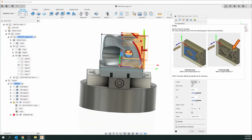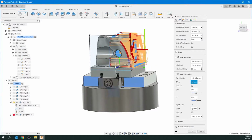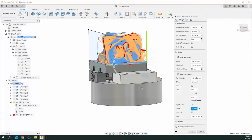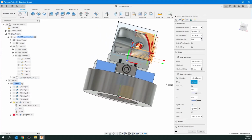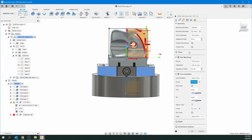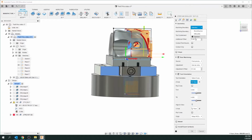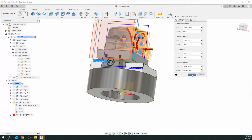And so click the Z-axis, I'm going to click on this. See the blue there is heading this way now. And for the X-axis, click on the right side. And there we have our icon or gimbal looking correct. So back up to the top, selection. That's right, but just click on undo that machining boundary with the X and then click on that new sketch. And that's all we have to do to produce the other side.